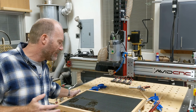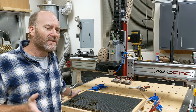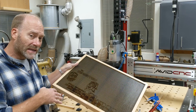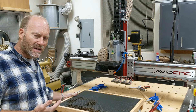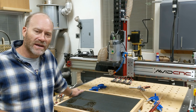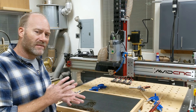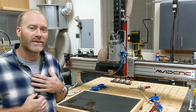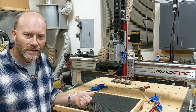Before showing the cutting and design work, I want to say something about safety. We're cutting a vinyl record, and vinyl is a pretty hazardous material to cut with a laser. This is my honeycomb table after I did this project, and you can see it left some pretty heavy staining. Some of the outgassing from cutting vinyl is chlorine gas, which can be highly corrosive when combined with water. If you live in a humid or damp environment, it's hazardous to your health — breathing chlorine gas is not good for your lungs, and it combines with water to make hydrochloric acid in your lungs. If you've ever breathed the dust from a chlorine tablet, you know exactly what I'm talking about.